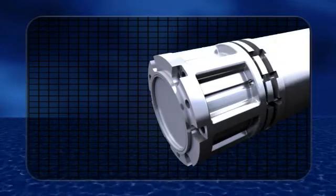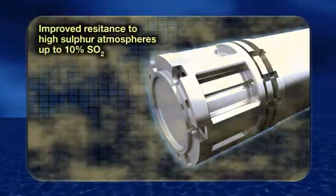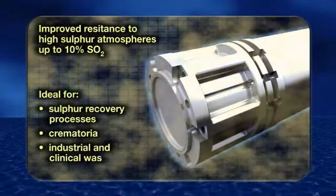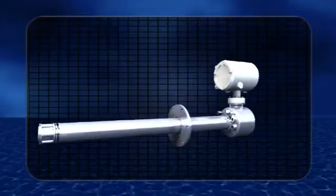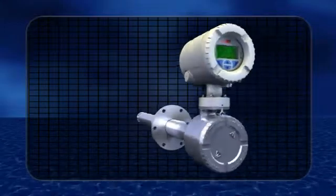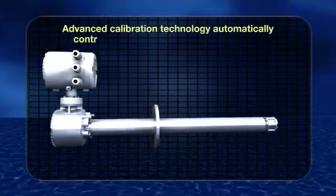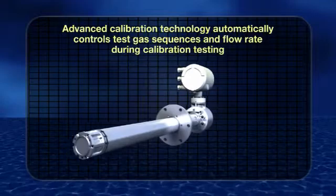The electrode bonding technique offers better resistance to sulfurous atmospheres, ideal for sulfur recovery processes, crematoria, and industrial and clinical waste. Another feature is the inclusion of integrated automatic calibration control technology, which eliminates the need for expensive ancillary equipment typically needed for traditional flue gas oxygen analyzer systems.